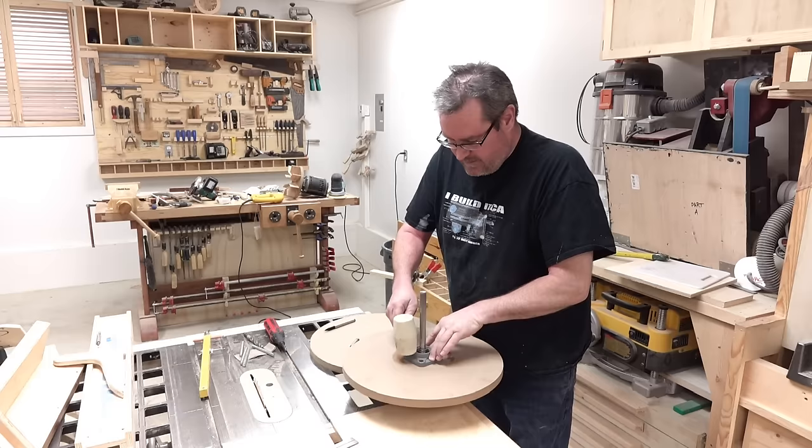A popular thing to use for the tires are bicycle inner tubes. Up until recently, I had them on my bandsaw, but I took them off to try an idea that I had. This is silicone caulking. This is 100% silicone, clear. A lot of people call anything that's in a tube silicone, but this is actually silicone. And it has to be. This is the clear rubbery stuff when it dries. And I'm gonna use that as tires on here.